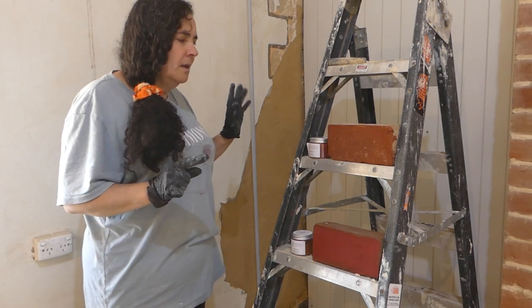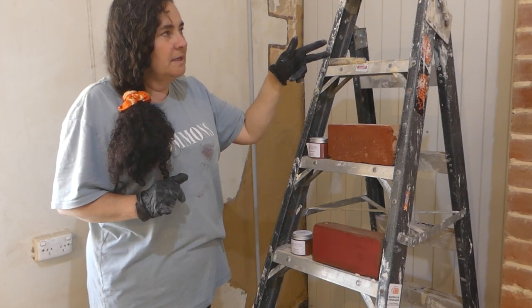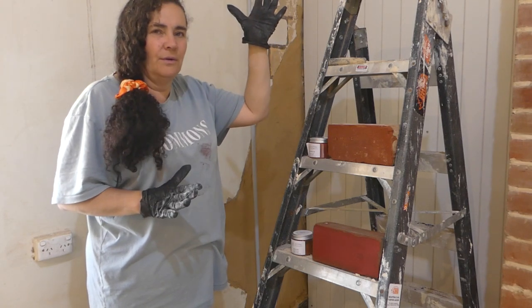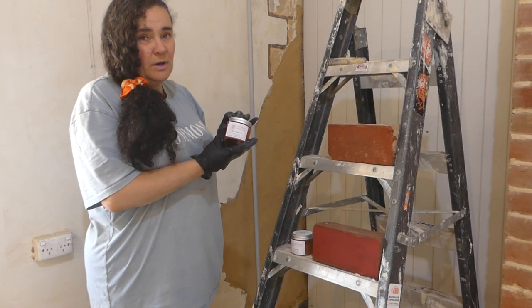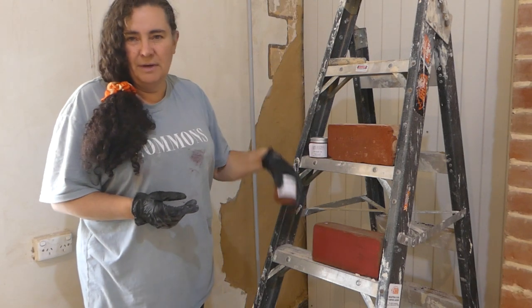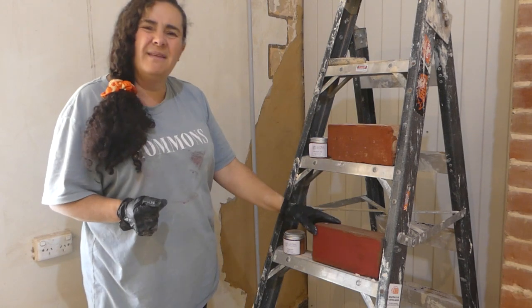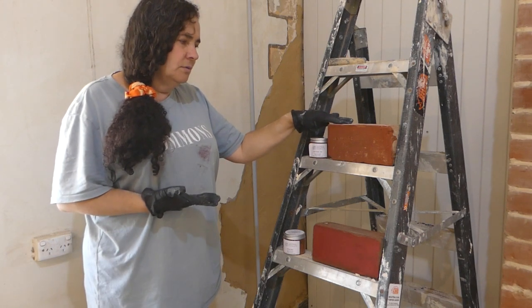And in the meantime, I'm going to recolour these bricks. So they were a deep red, and after I mortared everything, the mortar got on those bricks, and I've acid washed them twice, and they've still got a powder on them. So I ordered some of this stuff, red oxide powder. That's like a pigment. So I've got red oxide, and I've got Indian red because I didn't know what colour I wanted, and I've got some old bricks, and I've put it on both of them as a test, and I think this one's come up a bit fake, but this has come up pretty good, the red oxide, close to the original colour of the bricks.